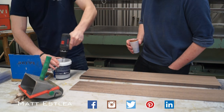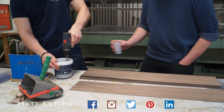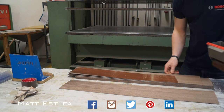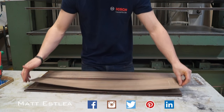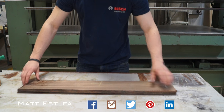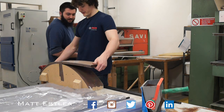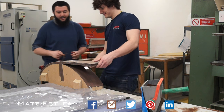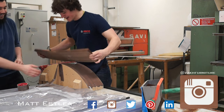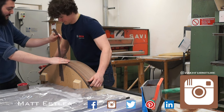Then Zac and I got sidetracked — well, we were actually just pigmenting the caskamite to make it match the colour of the wood better, because caskamite tends to show up with white lines on the edge of the laminations once it's all glued together, and it would look a bit unsightly against the dark walnut once finished. After getting glue between all the layers — we actually ran out of caskamite half way through, which was a bit scary — we popped it over the laminate former, getting it the wrong way round the first time as you can see here. I'll just detract your attention away from that to the little advertisement in the corner for Zac's Instagram. He makes some very nice stuff.